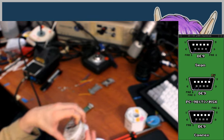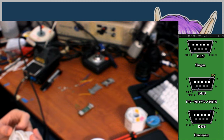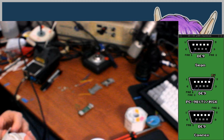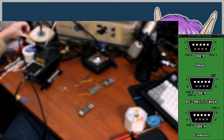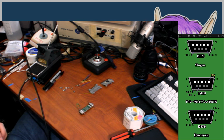But the ingredients list is also the same. The ingredients list, which I did not see at first because it's under the flap: WW gum rosin, CAS number 8050-09-7, diethylene glycol dibutyl, CAS number 112-73-2, dimerized rosin, CAS number 65997-05-9. And the same ingredients list was on this stuff when I was looking on their website. So I'm almost certain that's the same stuff, and that RadioShack probably was just licensing it from them, or having them put their label on their product.